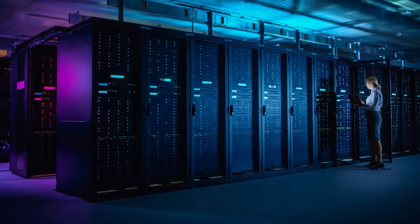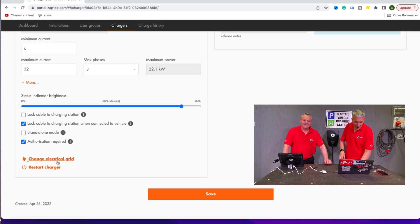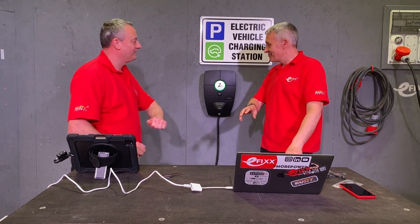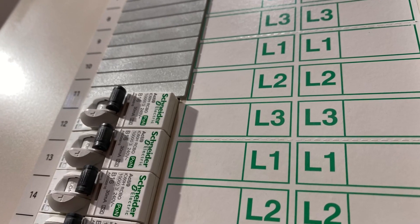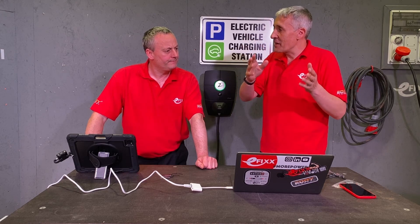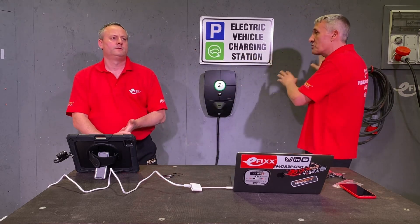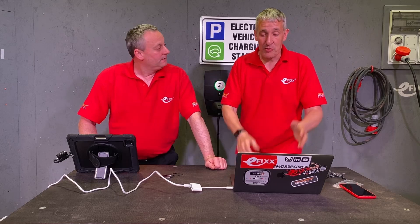So while you're in the portal, what else can it do? It can do lots of things, including this cool feature — click on the charger and you can run a little electrical test. You get to hear the relays inside clicking. If I just run a little grid test — satisfying! What happens is you can select which phase single-phase chargers are going to connect to. If all cars are connected to the same phase you could have a power balance problem, and the system can share single-phase loads equally amongst the different phases if you have lots of chargers — so with 12 EV chargers you could divide them between those phases. You can check that remotely, but what you'd really want to be doing is managing users.